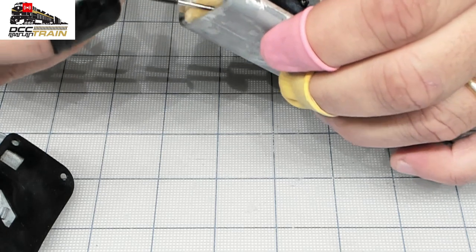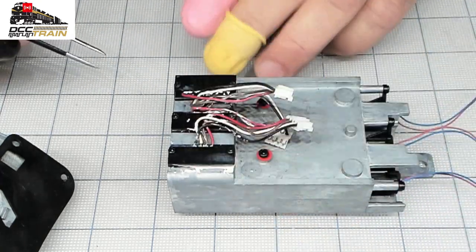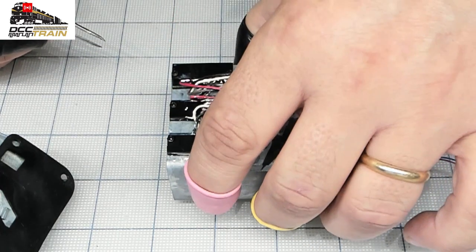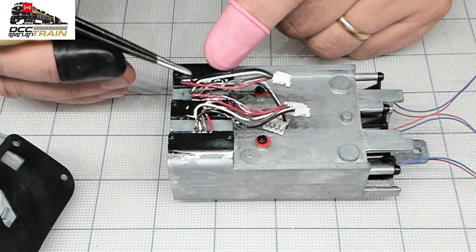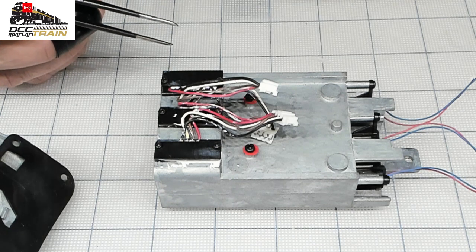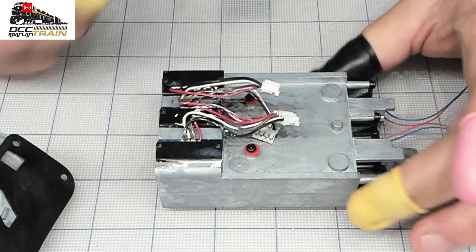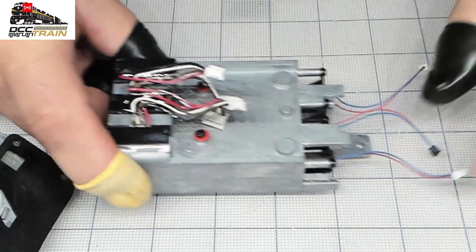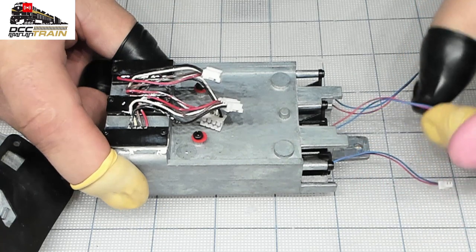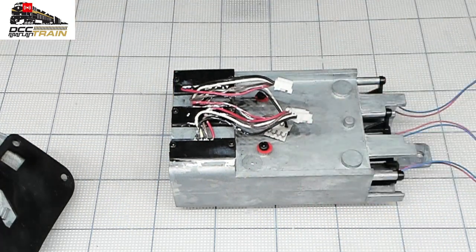My plan is to put something in between, but I'm not going to use the sensors — I'm just going to use the heating elements. The plan is to figure out with a programmer and software — which after the latest update changed something — how to adjust the technology Zimo uses with pulse width modulation (PWM) to work with this setup. Then I can connect the fans to different outputs and everything should work.